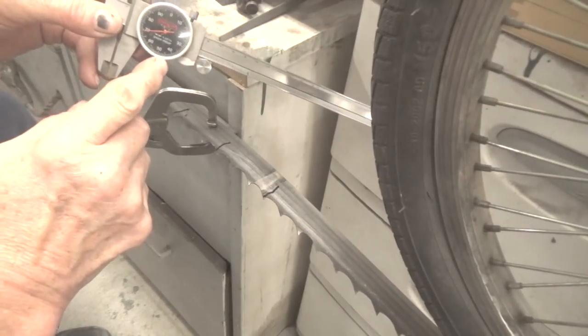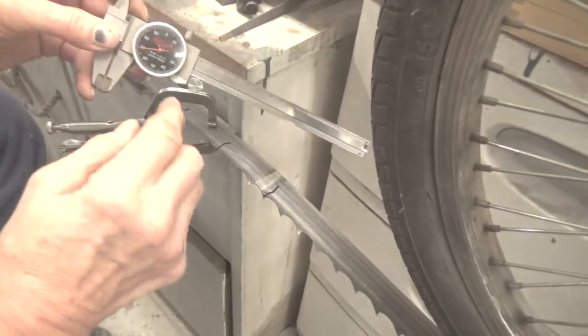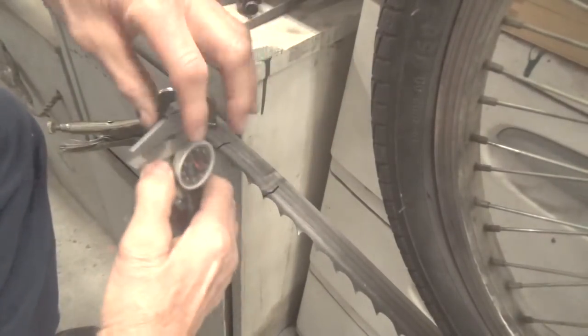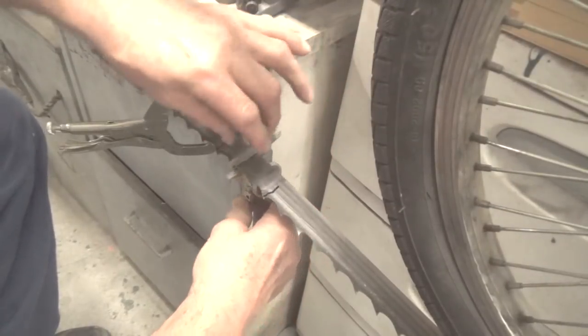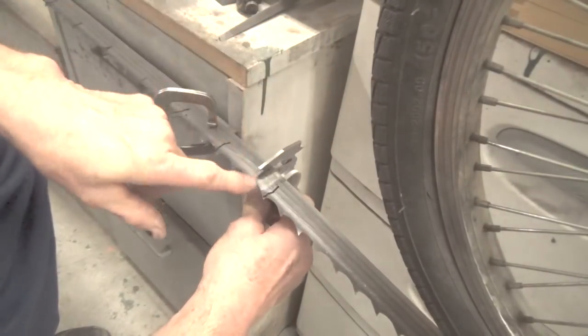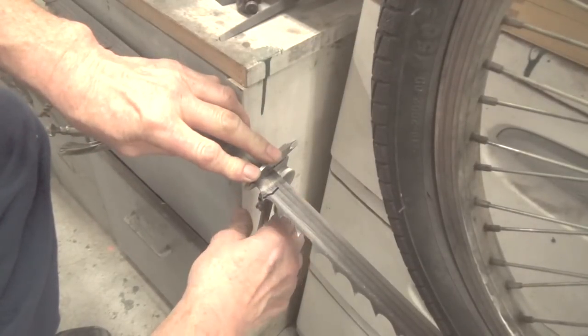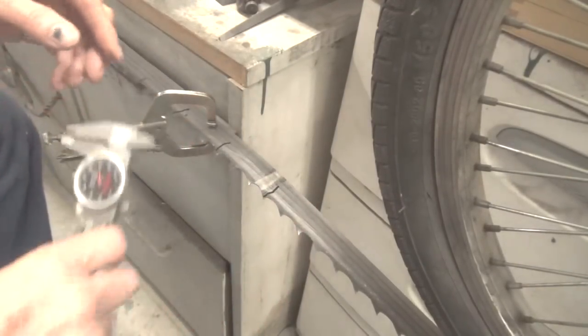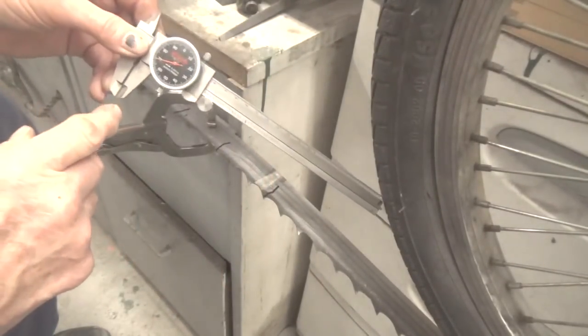You'll see this blade is 45 thousandths. Okay, so 10. This is almost 20 thousandths here. Now I'm not holding it the way I would when I was up top. I'm just saying you can measure with this. What I'm doing right now is you would only want to measure the blades that are going down this direction. Then what you have to allow for is the thickness of the blade plus the offset of the sawtooth.